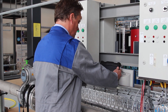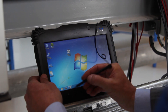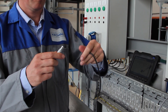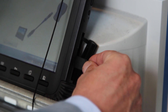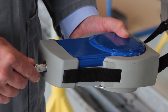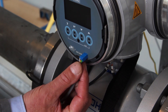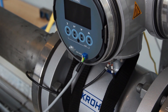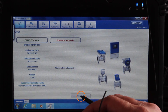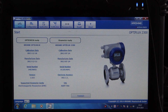Position the tablet and open the OptiCheck software. Connect the tablet with the 2-meter long USB power cable. Connect the green GDC cable. Power up the IFC 300 and press connect to identify the OptiCheck. Select the corresponding flow meter and it will automatically detect all relevant data.